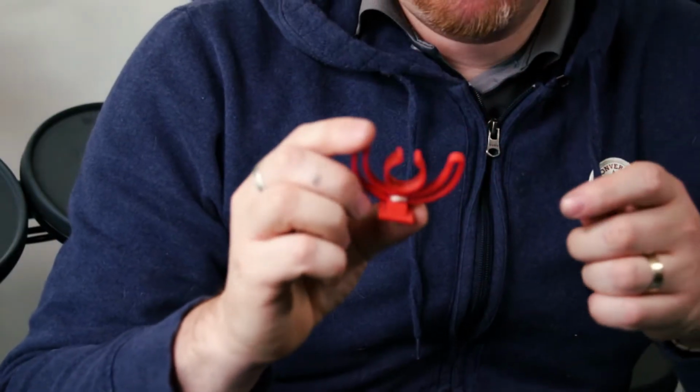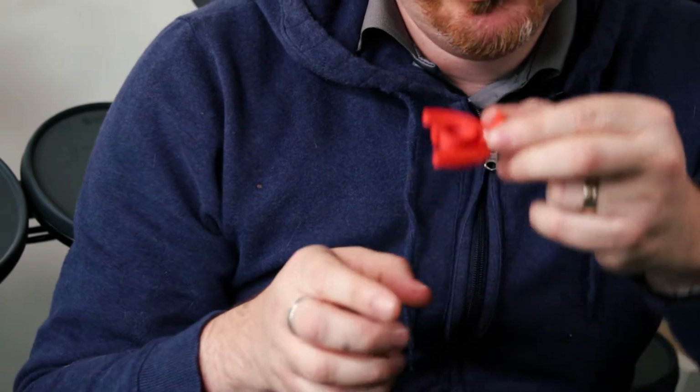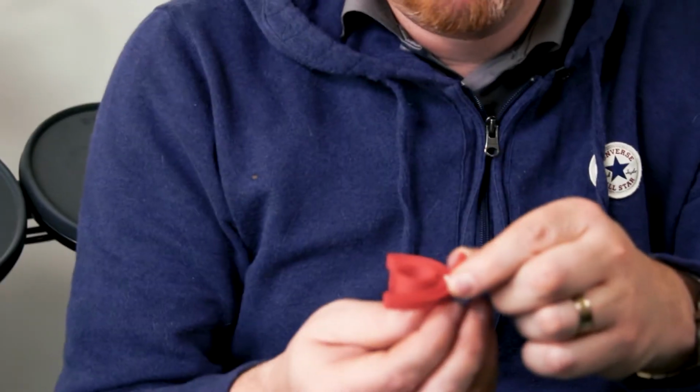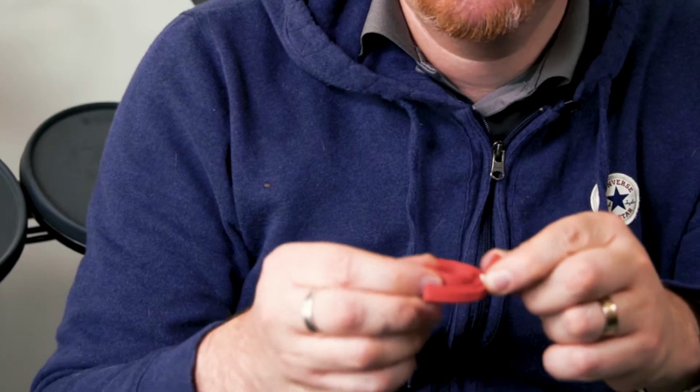But this is the microphone clip. Okay, so the microphone clip itself, it's printed in ABS plastic, and when I printed it horizontally, like so, laying down, by printing it horizontally, the grain of the 3D print is stronger in the directions we need it to be. Before I get too much into the performance of this thing, let's spend a minute or two to show you how to mount it to a camera and how to use it.